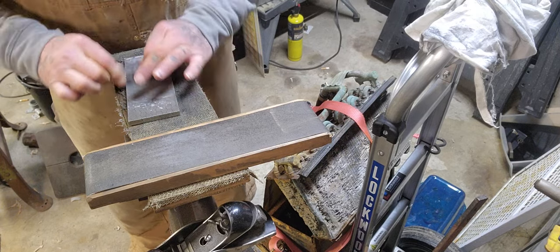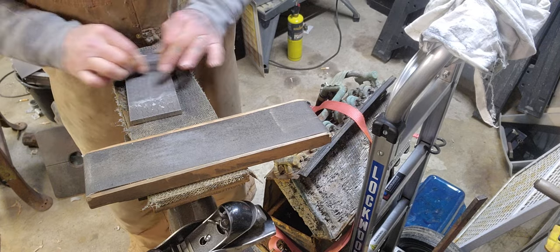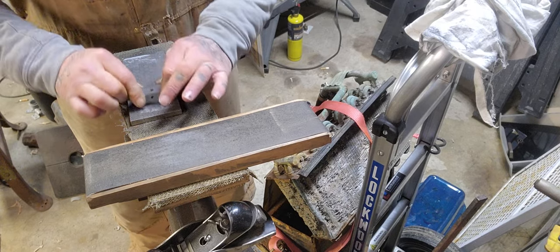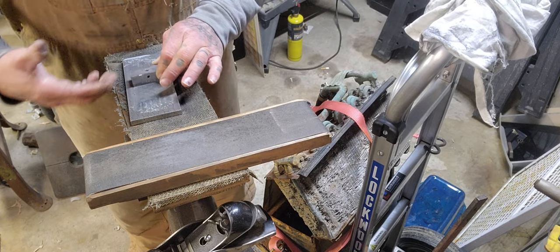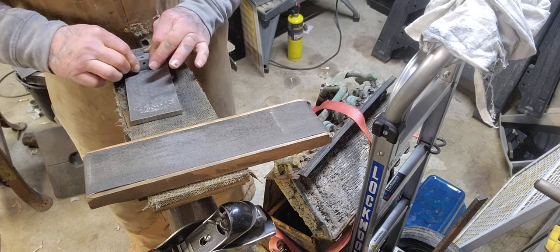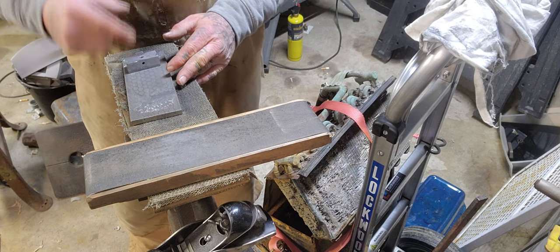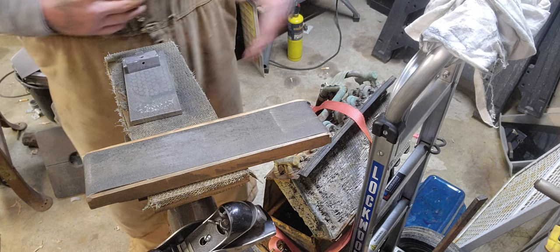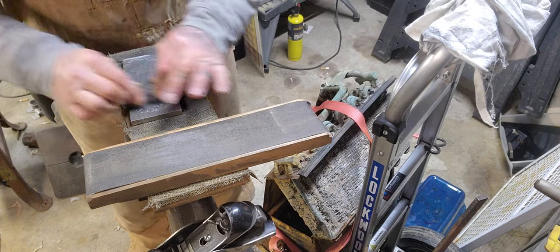how to do this. And if you notice, I do rounded. Like, I go around and around and just keep spinning in different ways. That's all I do. I notice if you go up and down like this constantly, it seems like it hydroplanes, you know what I mean? That's what it feels like to me. But if you start moving it around, it feels like all that stuff gets down into that. That's what that honeycomb pattern is. It pulls that slurry down into it to where it can make another cut, another cut, another cut. So I go and round it.